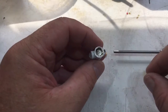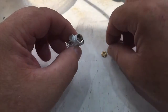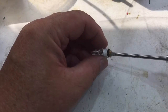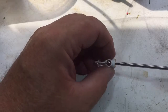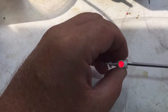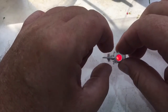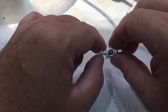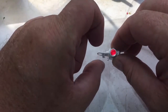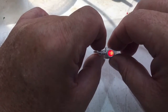Now we've got the battery in place and the LED will hold it there. We've got to make sure we slacken the top off a little bit, say halfway. We take the brass ferrule, put it on our hex wrench, and screw the ferrule back in place. I'm going to keep screwing it in until you just see the LED coming on. If I tighten the little cap down it squeezes all the components together; slacken off and it goes off. The lamp works on a dry joint principle — when you screw the top down you shouldn't have to tighten the life out of it. Tightening basically squeezes the components together, removes the dry joint, and creates a good joint which makes the lamp work.